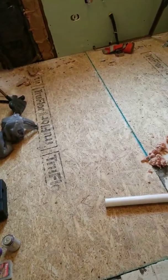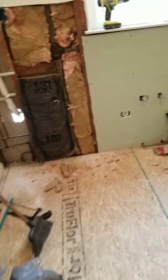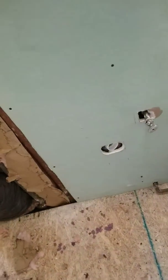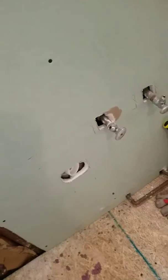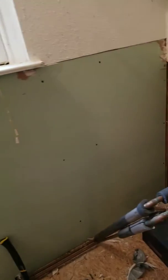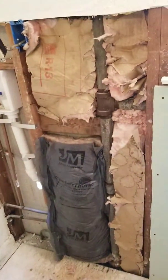Came down the middle with screws to attach it to the sub flooring, to the two-by-fours. Insulated this wall out here, got finished with the plumbing — I had to redo the drain here. There's a two-inch steel pipe that comes up and cuts over and goes up out the roof, so I tied into that for the breather for the sink drain. Got the sheetrock put in, so all of that is insulated back there behind the new sheetrock.